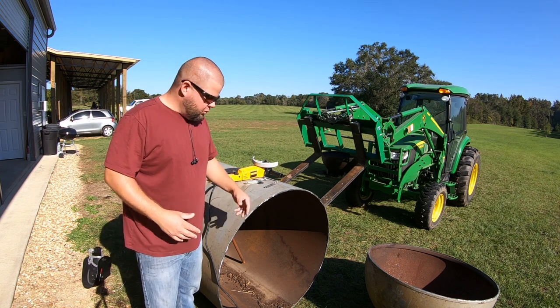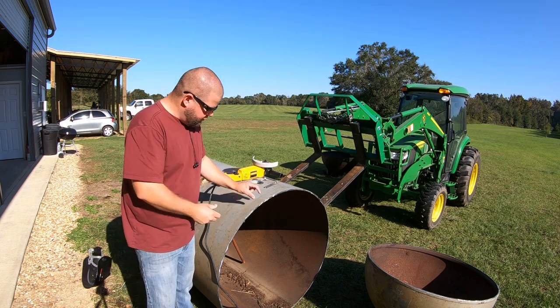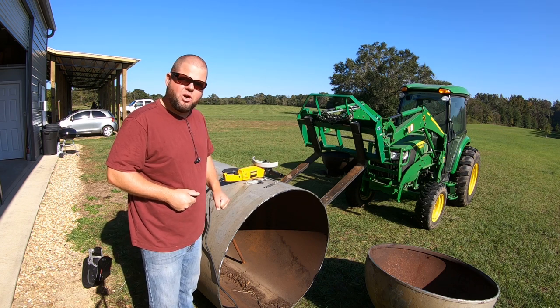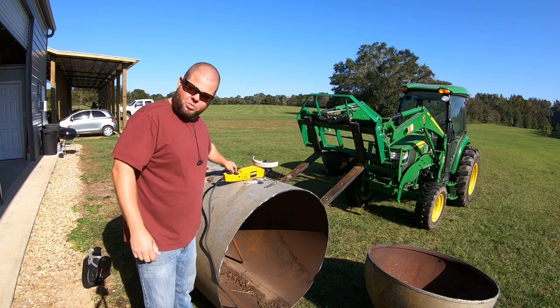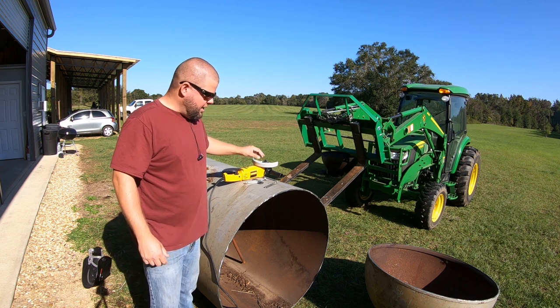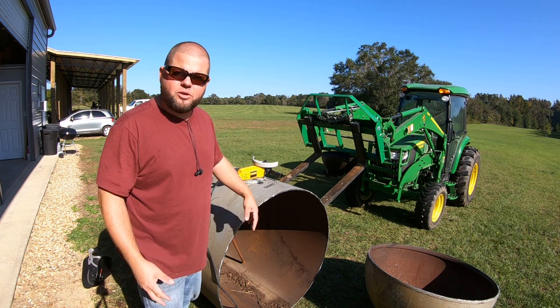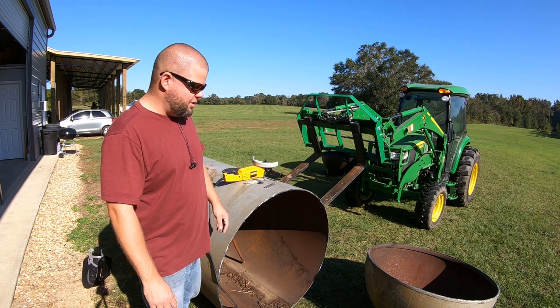Like I said, next time I build one of these, I think if I tack weld every so often or leave a small stretch of metal that I may come back and even cut with a Sawzall to keep from pinching these blades that are going 8,000 RPMs, I think I can be more successful next time and maybe get it down to where I'm using two blades, you know, $10 worth instead of $25 to make a cut.